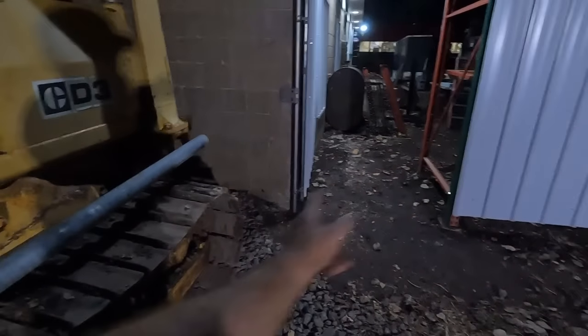And I'll weld this little chunk to this longer chunk, and then the clamp will go over that. And then boom, we have the ability to have a hinge that can be taken off. And that little piece will just ride up in there. All the weight will just sit down on it. It should work.